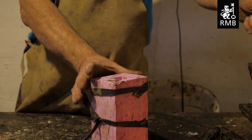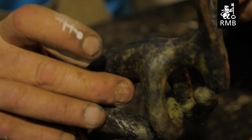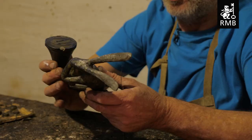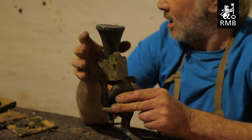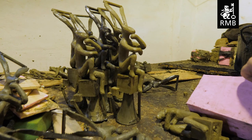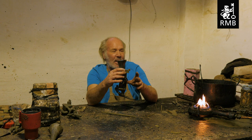The process of realising this hare in bronze involves the lost wax process. So this is the wax part of the process. You take molten wax and throw it into your silicon rubber mould. Sounds simple, but it's not always. So here we're realising the wax. It still needs to be gated. Gating is a plumbing system that you put on. So here I'm going to put a funnel, and then I'll connect some risers, which allow the wax to escape. And when the bronze gets poured down the funnel, the gases escape.